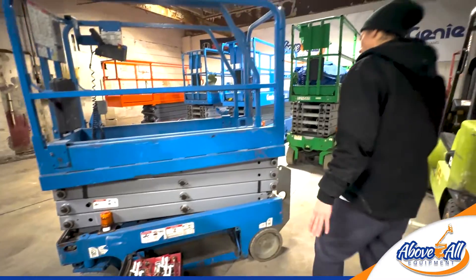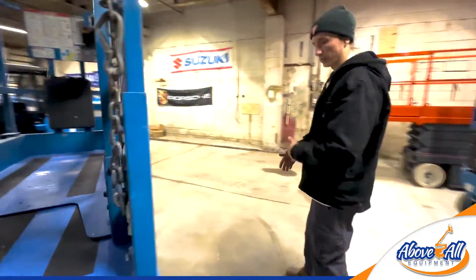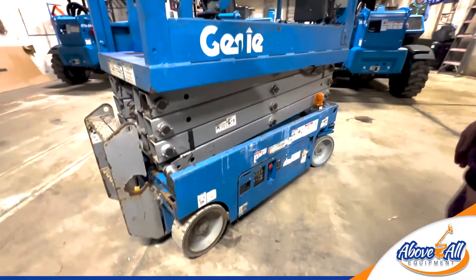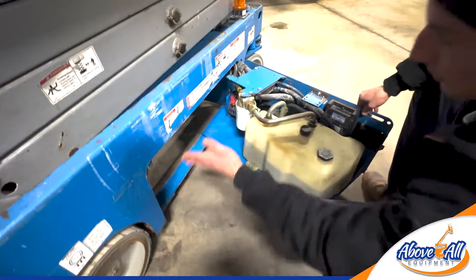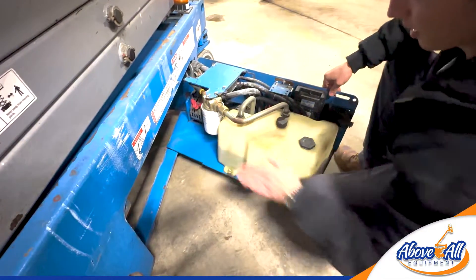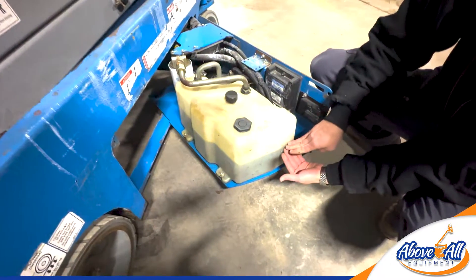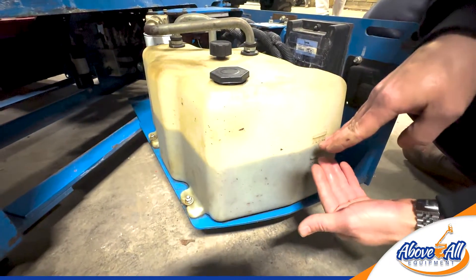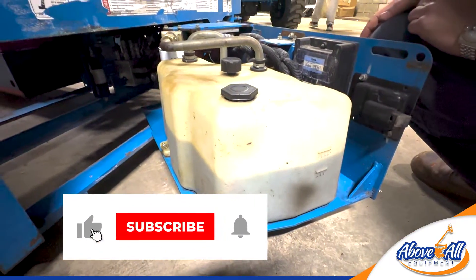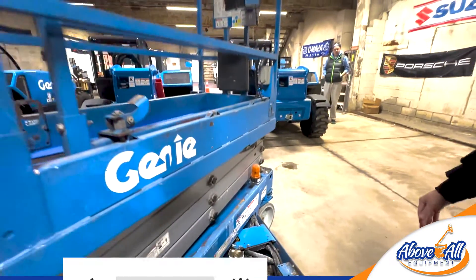On the other side of this, it's a quick thing before you're going out there. Obviously you want to look at your tires and make sure everything's good. But your hydraulic fluid is extremely important — this is your filter here — and at the minimum your fluid level should always be in between 'add' and 'full' before every single use. Other than that, read your manuals for your safety and you should be good to go.